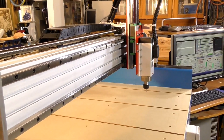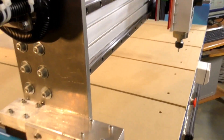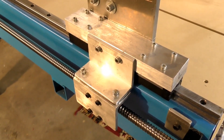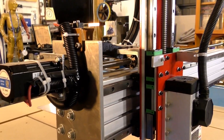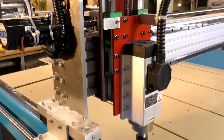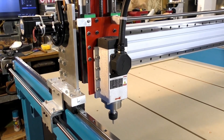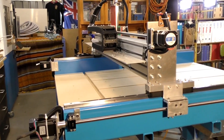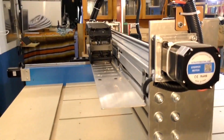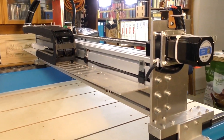And this is its maiden run. What I normally do is make sure everything is working all right — none of these stepper motors are getting warm and they're not binding anywhere, it's all running smoothly. I think I'm doing a metre circle — it might even be 1200mm, I'm not really sure. I just let it run like that for four, five, six hours — a considerable time, really, considering it's a brand new machine at this stage.